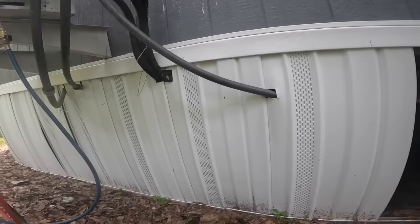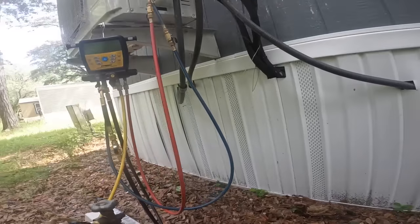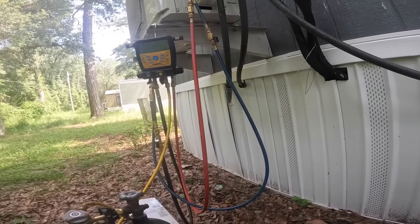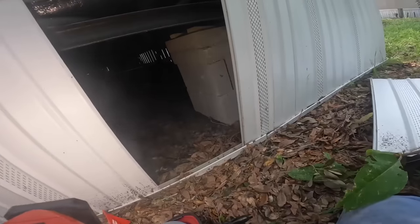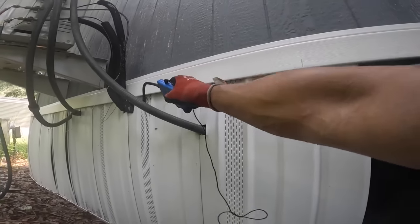Now, I don't think anything's marked underneath. I'm gonna take this down there and see if I can find it. I'm gonna pump it up a little higher. I'm thinking it's either going to be a flare joint or where something has rubbed. Mikey mates, let's take another trip down under. Let's see what we find. Right, I'm at 333 PSI on that. And the first place I see to look is actually right here.